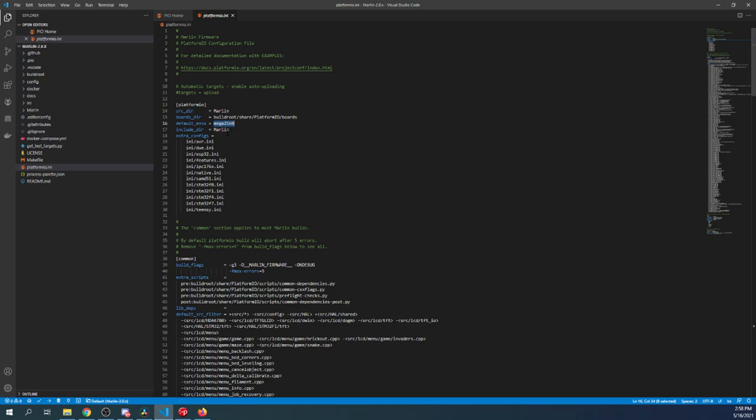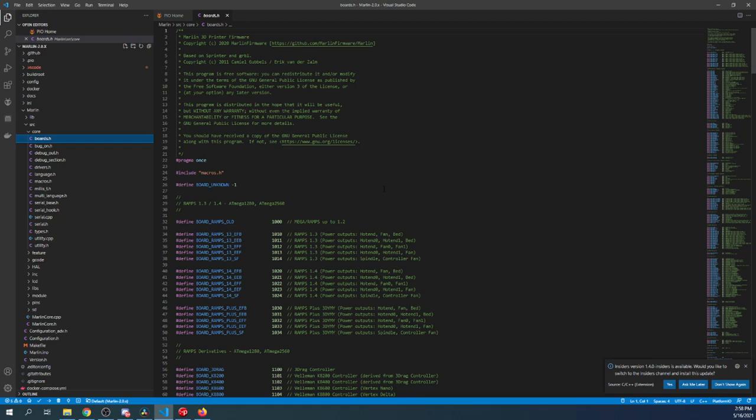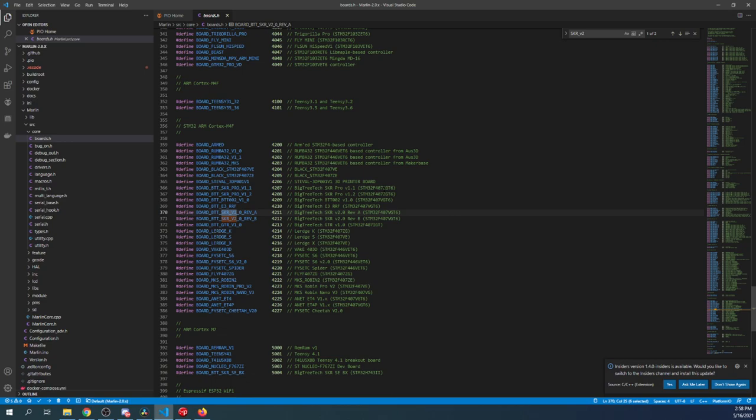So we're going to go over to the Marlin folder, then the source folder, then the core folder, then boards.h. Inside here, we're going to search on SKR_V2. And what you can see here are two different boards. Now, the Rev A board is a defective board, so you don't want to use that. So you're going to have to check the back of your actual board or the link that I leave in the description so that you can see how to get that replaced.